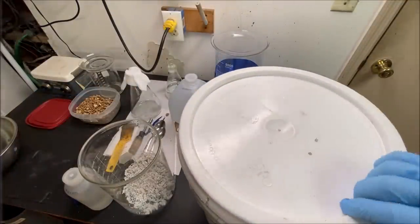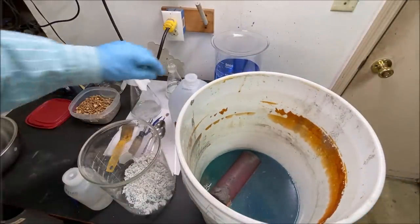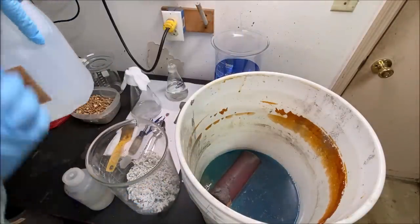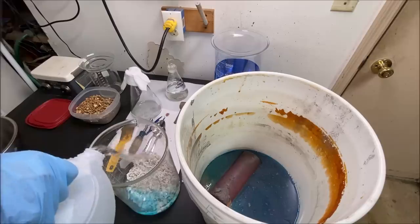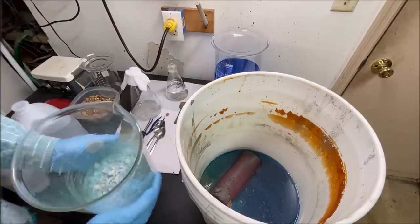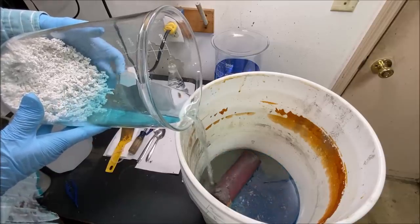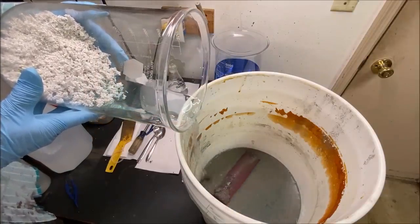Here I have a five-gallon bucket that I'm using to cement the silver out of my solutions. I've got some distilled water in this jug, and what we'll do is give the silver multiple distilled water rinses until we get all the electrolyte off. I'll shake these around — you can see the liquid is blue because there's electrolyte in it. I'll pour this off into the five-gallon bucket that has copper in it to cement out any silver being poured out with the electrolyte.